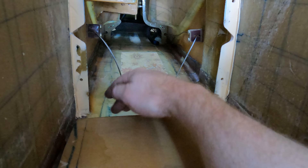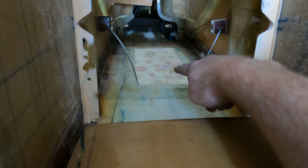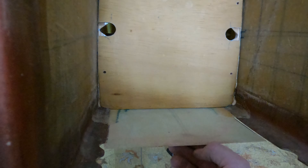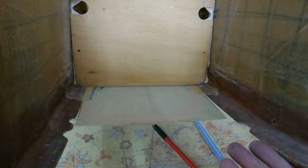It's kind of an L-shaped layup going onto this bottom closeout panel. You can see it's got an oil-can effect to it, so this will help make it a little more rigid when the access plate goes in. I'm going to do the layup, put some release tape on this paper here, place the layup on it, carefully bring it in, lay it down, press it in, then lift it up. I'll crawl underneath the airplane, come in through the other access panel on the bottom, and do final adjustments. Once the whole setup is in, I'll know how much of this to trim off to close out the hole that was for the monowheel.